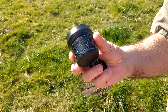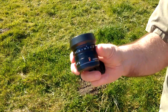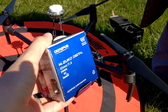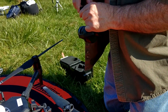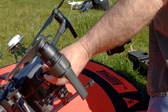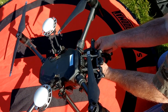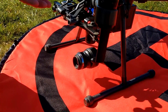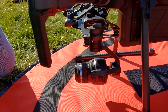This is the 15mm Olympus lens that we're using for mapping — we attach it right onto the X5S camera. Now here's the 45mm lens, but it doubles up to 90mm when we put it on this X5S. So we're just going to mount that on this dual gimbal — just like you'd mount on an Inspire, it's kind of the same process. You have to add a balancing ring to the lens in order to balance it on there because it's such a long lens.